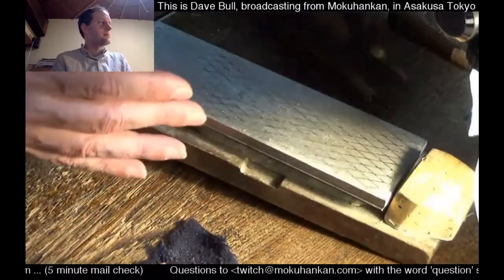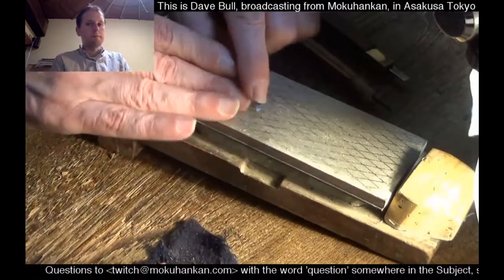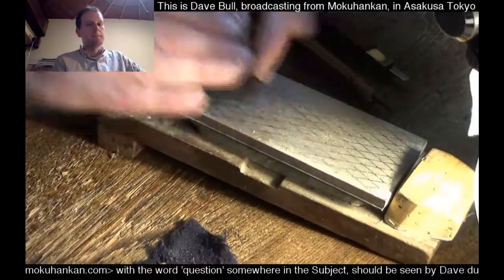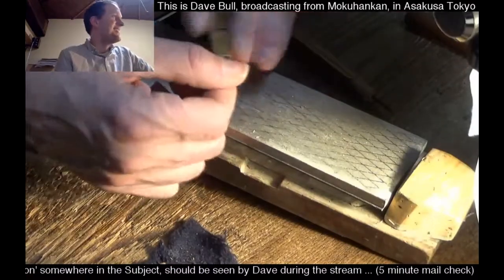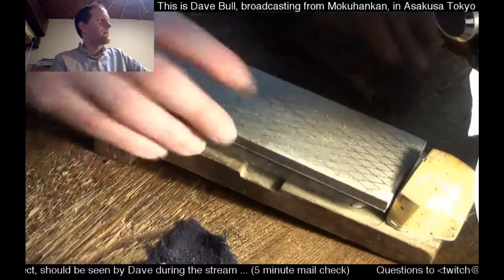So when you're doing the main carving knife, the bevel is flat. Your main challenge is to hold it flat on the stone as you're moving. If you rock and rock and rock, you get a curved bevel and it's difficult to use the knife. Yeah, and it changes the type of knife it is. So this one is the other way around. If we don't want to move flat, we want to rock, rock, rock. So to me, that makes it easier, actually.